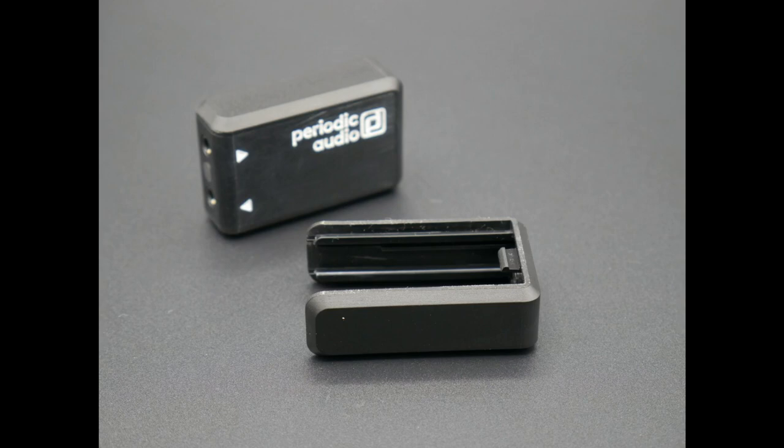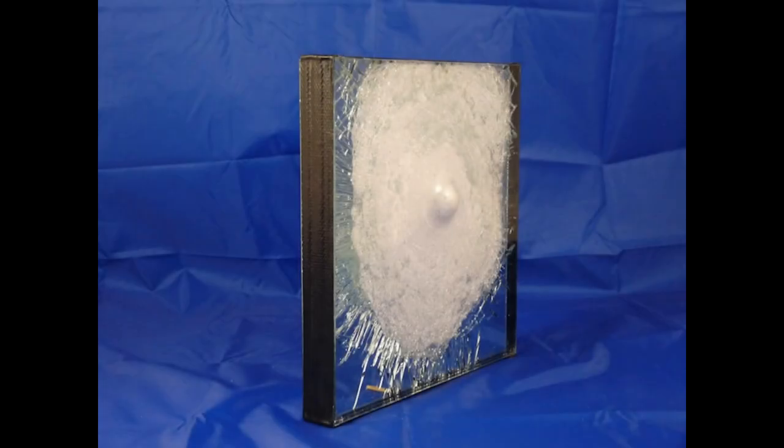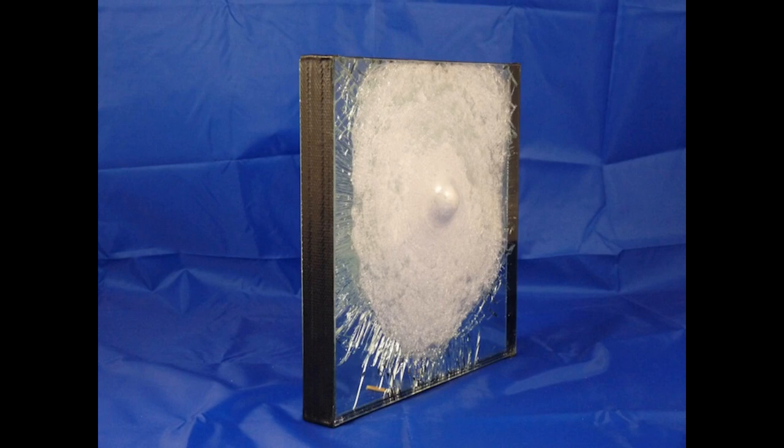The enclosure is two pieces: a wrap-around sides-and-rear piece, and a shell on the top, front, and bottom. Both pieces are molded from polycarbonate and are at least two millimeters thick at all points. Glued together, they form an incredibly durable yet lightweight enclosure. Polycarbonate is a thermoplastic polymer — better known as bulletproof glass — insanely durable and flows very well in the mold.